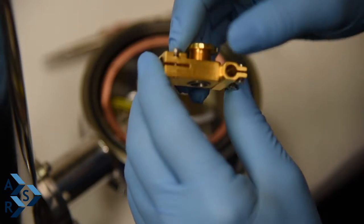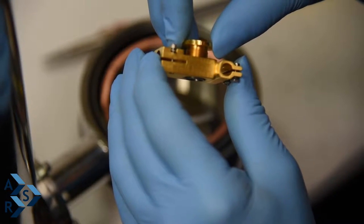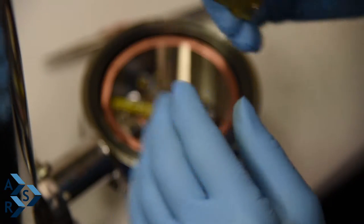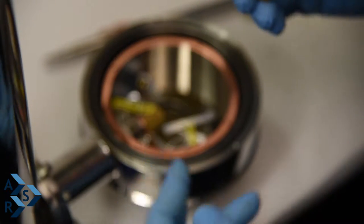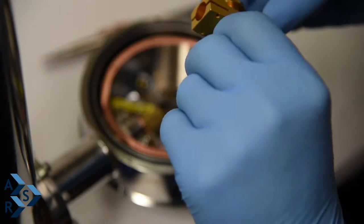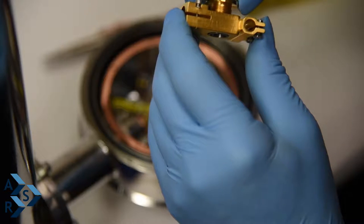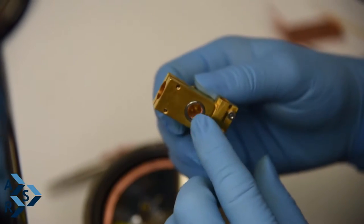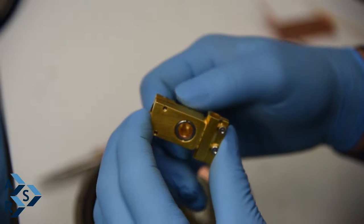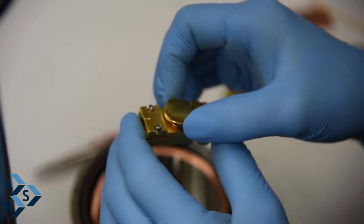What that does is, if you have a sample holder with threads, you get a little vibration and a little shift. So with this, you could adjust it from the bottom. If you take the bottom shroud and your plate off, you could screw this in tighter so you could set the height of your sample. As you turn clockwise to engage this, you see it turning. Once it bottoms out, it'll lock in place. That will help stabilize the sample.